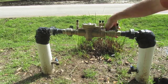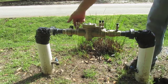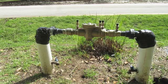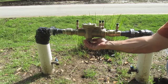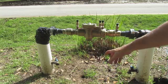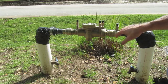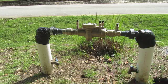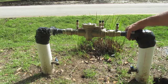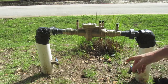You may need to hand-tighten your union connections if you see a little leaking. Turn on your water source, check here, tighten if you need to, then turn on the first valve, then the second. You can hear the water going through. Inspect for any leaks - a leak from the middle of the valve is more serious and could indicate a defective backflow valve. Leaks at the unions you can hand-tighten, or use channel-lock pliers if necessary.